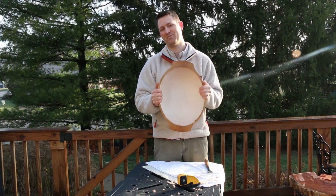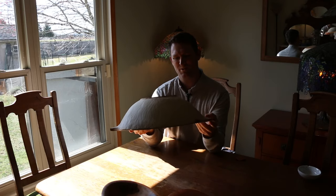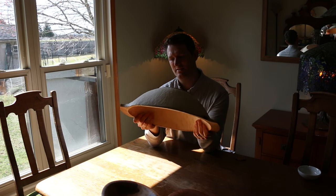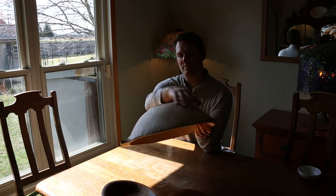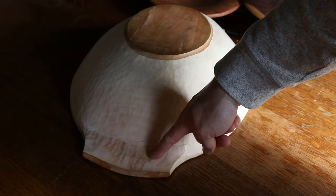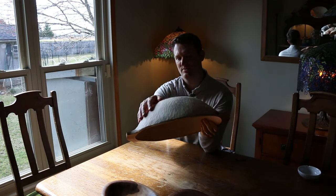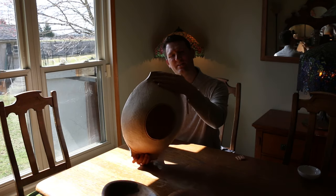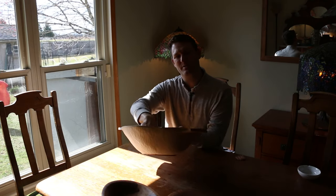It's a beautiful spring morning — I'll keep carving and get back to you when we've made some progress. I've pretty much done the convex portion of the bowl and want to highlight two things. One, I haven't done the handles yet — I always do those after the main bulk, because as your gouge comes down toward the handle, if you've spent a lot of time making it perfect you'll likely ding into it finishing the convex portion. The other thing I've noticed about this wood is it has a lot of very wavy grain, which gives a nice almost tiger-striped figure but makes it very difficult to get a super smooth tooled finish because you're constantly dealing with changing grain direction.